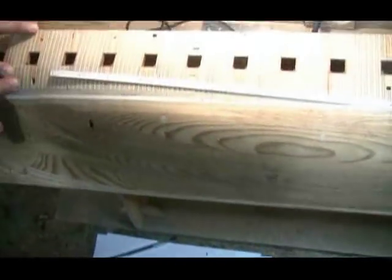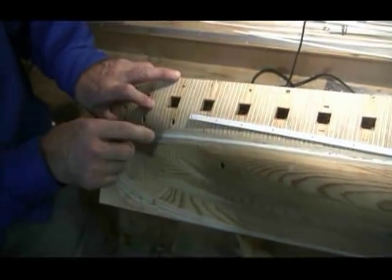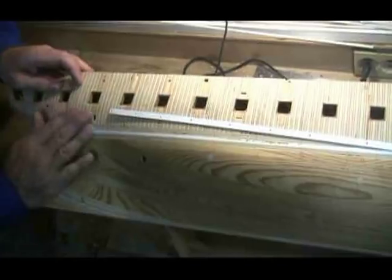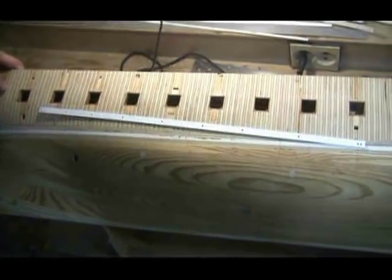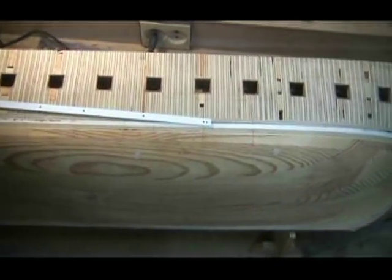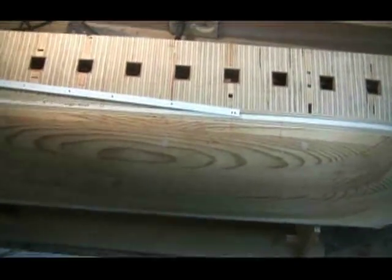So wooden nails do not damage the hull, because these holes can then be easily filled with the same wooden pins, and you trim the additional parts of the nails away with the help of a chisel or knife.